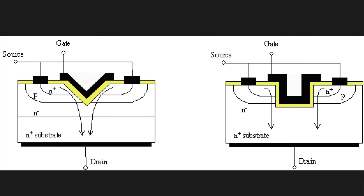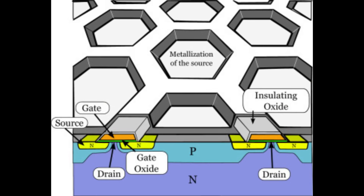You could also do what's on the right-hand side here, which is kind of a rectangular structure. But imagine looking straight down on this from a high viewpoint — that might be a cross-section of a hexagon. You don't know if it's a hexagon, a parallelogram, a square, or a circle if you only have a top view. The HexFETs are indeed hexagonal structures that allow the currents to go vertical.